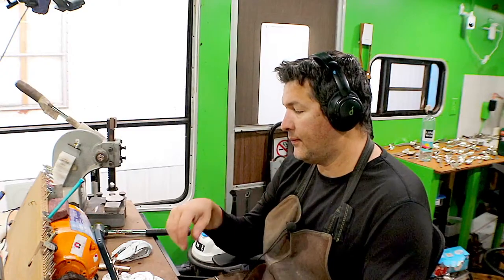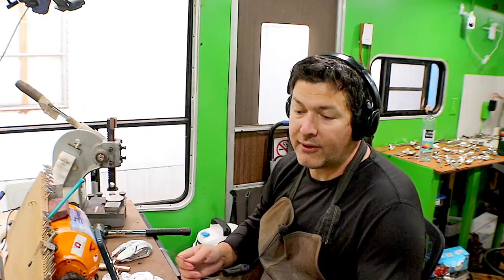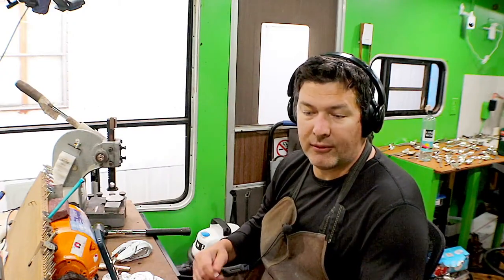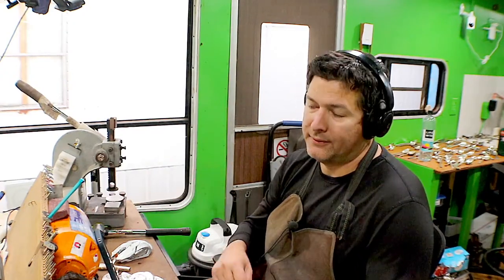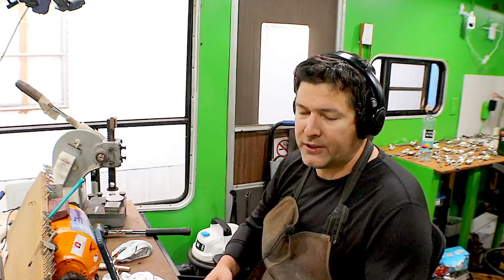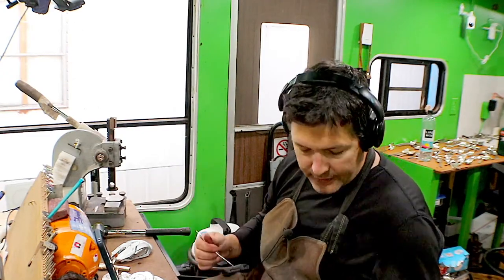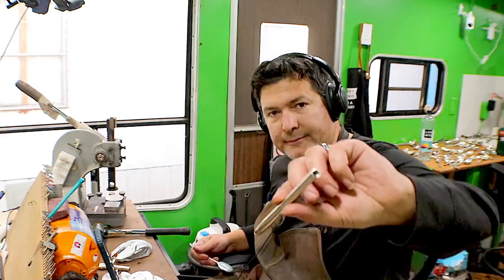So the next time, well, I set it for an hour, but normally half an hour, Dawn dish soap, hot water, we'll just clean most of that up. I run for half an hour, just a big squirt of Dawn, and just let it run. The water pours out black, fill it up with water, more Dawn, tumble it 30 minutes, and so on. And it's normally about three times until you get to this point. Nice and shiny.